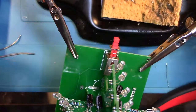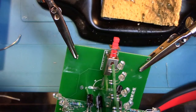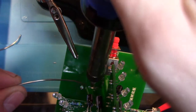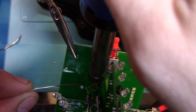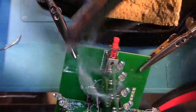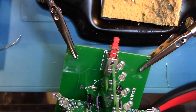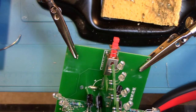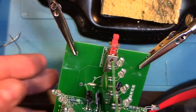Now we are going to solder the tree boards to the square base board. There are 8 points where we will have to solder to the board. This was a little tricky to not only hold the tree to the base, but also to get into the tight spaces with the soldering iron. I found I had to place the square board in the helping hands at a bit of an angle in order to get the first solder joint done. The rest were just a matter of angling the board so that I could get the soldering iron in the space and solder the joint.